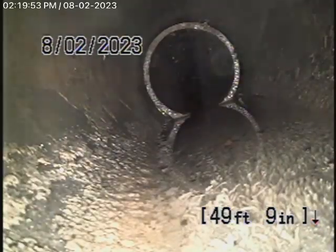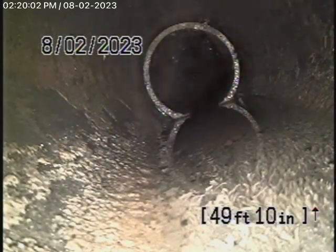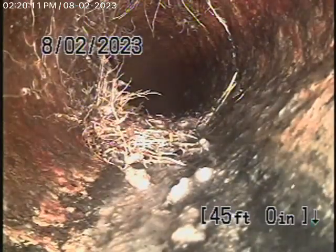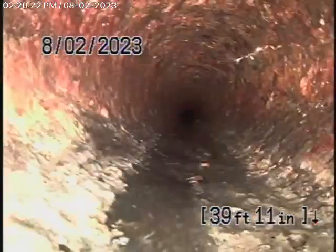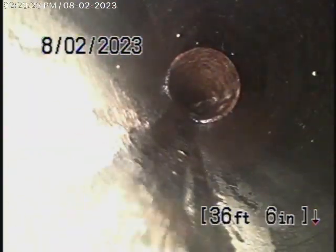We've located the clean out outside. Just before that, it looks like a yucca tree or something with the pipe that exits the house. There's the clean out outside. Keep coming back — this cast iron pipe underneath the house is at the end of its life and needs to be replaced. I've marked it where it exits the house. There's more roots getting in. It comes back to a short piece of ABS plastic — obviously a repair was made — then back to very old cast iron.